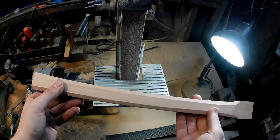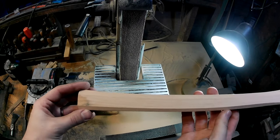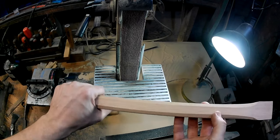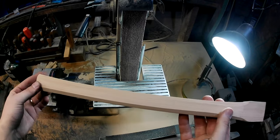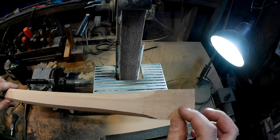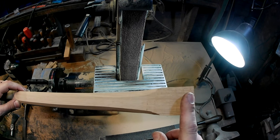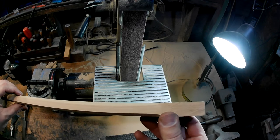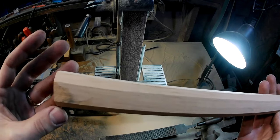We have our facet going now on the cross section, just about the way I like it. Don't be afraid to hold the axe and make sure it's comfortable. I did take it in a little more on the width and adjusted accordingly. I should note: the last two inches I did not touch — it's full thickness and width. This is the portion where the axe is going to get mounted to the handle, so we want lots of room to lay out the portion that goes in the eye of the axe.